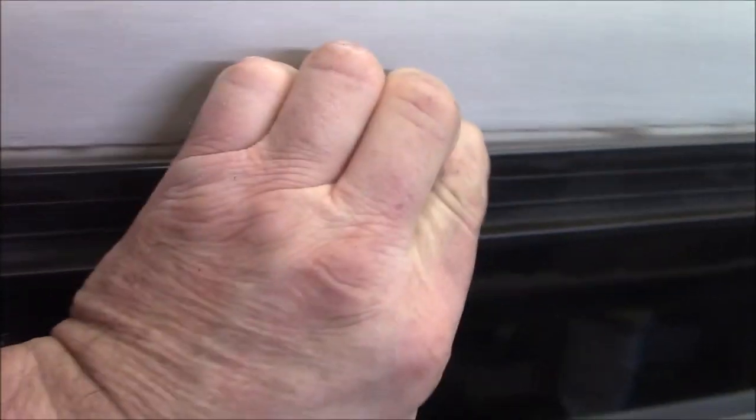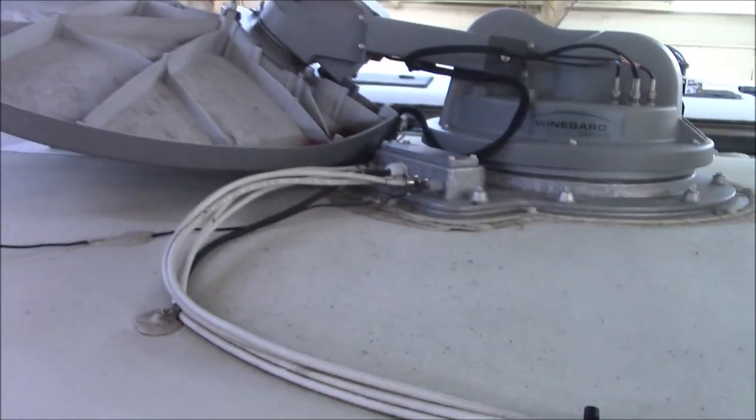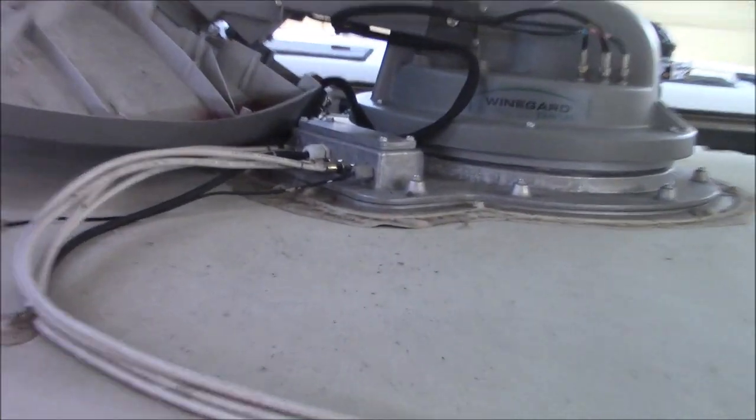And then the caulking up here, you want to check it like this, and if you hear it crinkling, then you know you got some issues, especially if it's silicone, it'll make a crinkle sound. But that's all they do is just put all this cow pucky on here. That's what they want to do. They want to exploit people's ignorance to roof systems. You can see a piece of it right there already coming out. See if I can zoom in right there.